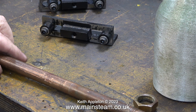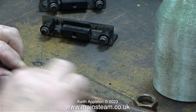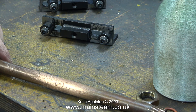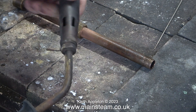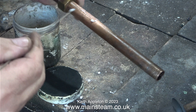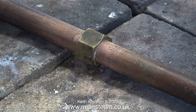If you watched the last episode where I bored out the nut to fit on the blast pipe, it's now time to silver solder the nut to the blast pipe. A viewer mentioned he liked the idea of soldering the nut to the blast pipe, but I must stress — it is not soft solder, it is silver solder. Temperatures inside the smoke box would melt soft solder, but not silver solder. The first thing to do is clean up the piece of copper pipe, and then I'm going to silver solder the nut over the most damaged part caused by using a pipe wrench to fit and remove it in the past. I'm now in the outer part of the workshop changing the nozzle on the blowtorch, as this is going to require quite a lot of heat. One very important thing not to forget at this stage is the flux — this is Easy Flow Number Two flux — and after a generous application of flux, it's time for some heat.